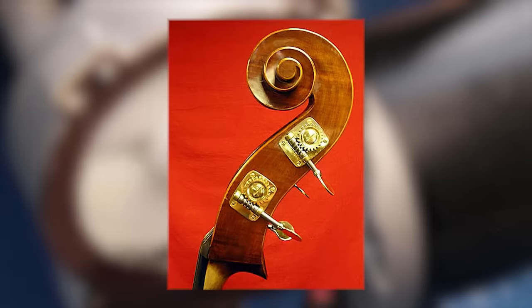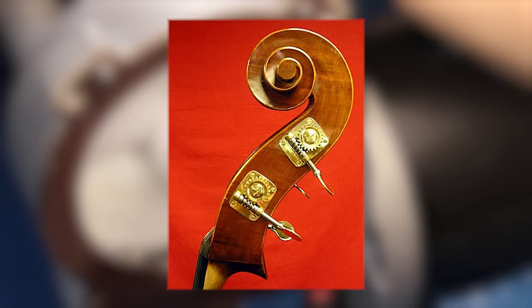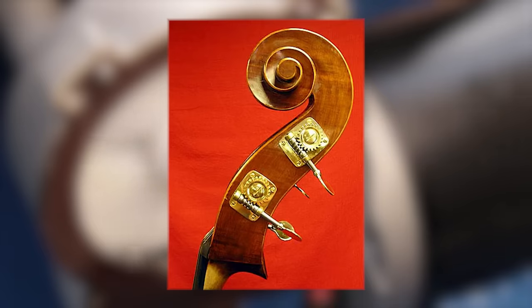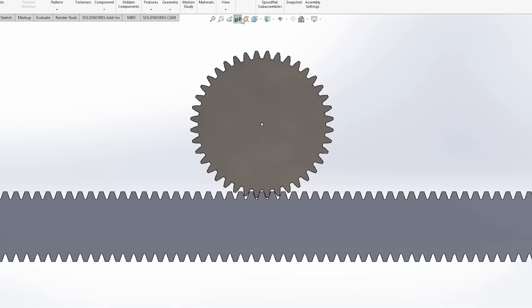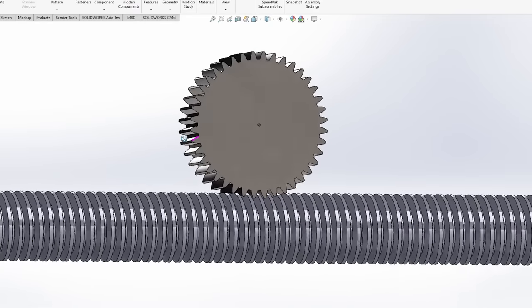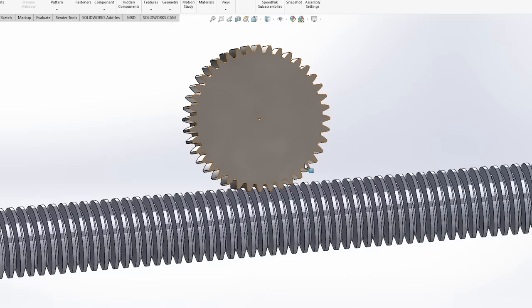I think one example would be the mechanism which allows you to tune the strings on a big double bass. The string is tensioned by a shaft that's connected to a worm wheel, but it's all held firmly in place due to friction. Interestingly enough though, a worm shaft is just a gear rack, except instead of being cut in a straight profile, the profile is a helix, and instead of the rack moving backwards and forwards, it instead rotates,